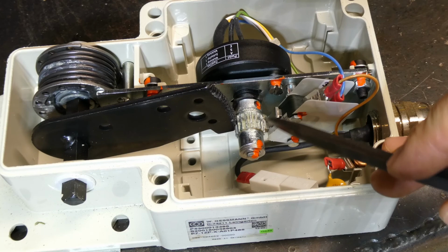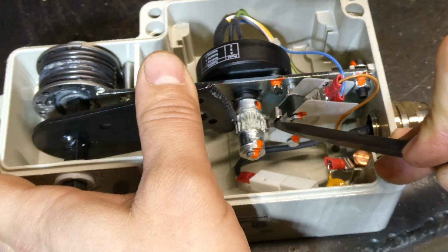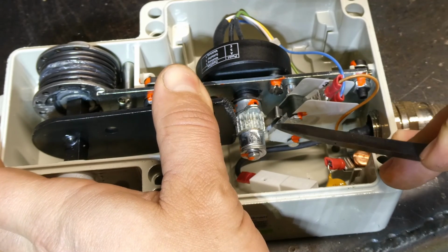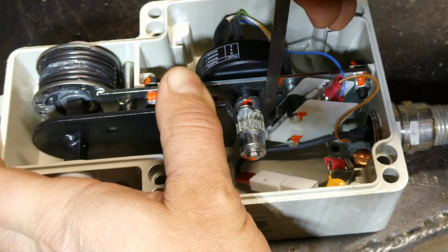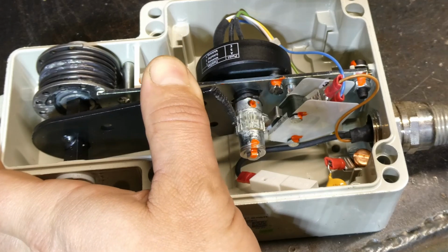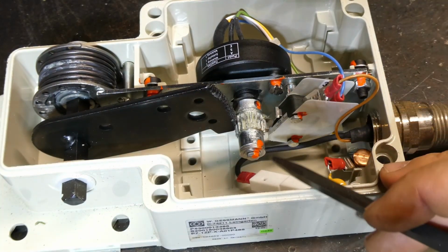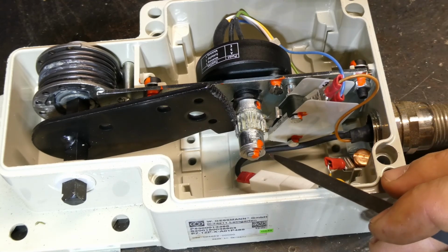This bit here is actually really tricky. As it depresses down, you might see that we've got a little nodule there. That part there actually actuates on this part, which is a micro switch. So that's actually what starts your arc. And as you can see, there's little red markings all over it where they've set it up in the factory to get it phased correctly.